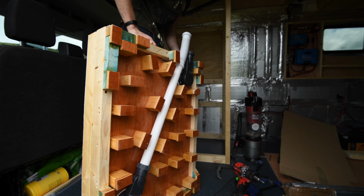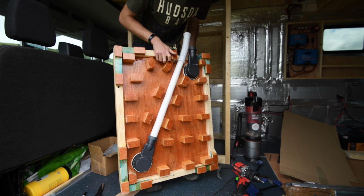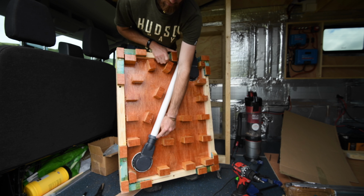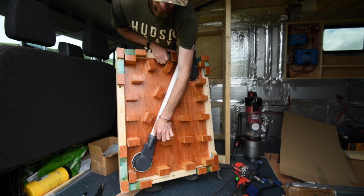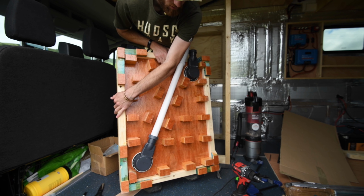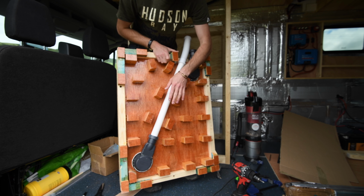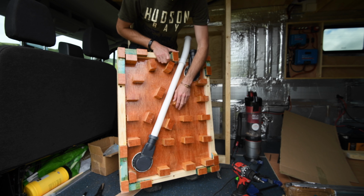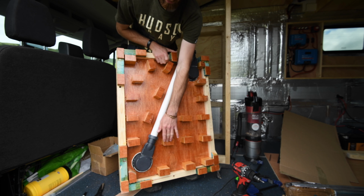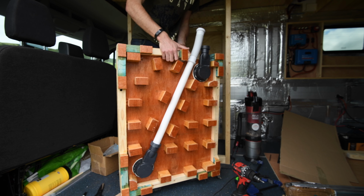So it's finally time to get the shower tray frame in. These are going to be accessible from the outside, but this one isn't. So although this is a compression fit in and I'm sure it won't leak, I've also just filled the outside of the pipe here with CT1, which is the same adhesive I used to glue the tray down, just to make it really sturdy. Although it's compression, I was worried that over time with shaking the vehicle, it might shake loose and it won't be accessible to do any maintenance on without cutting out a huge section. So yeah, let's get it fitted.